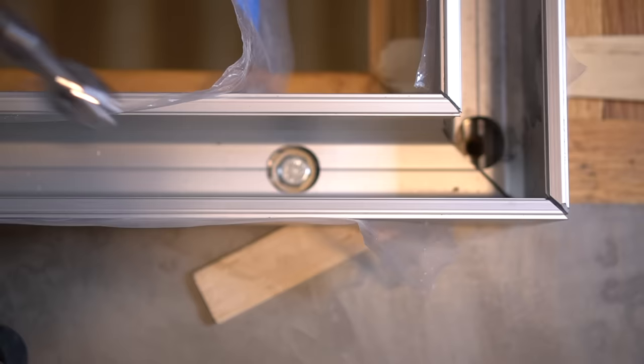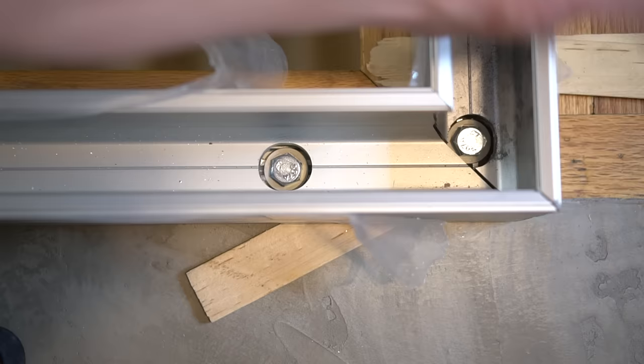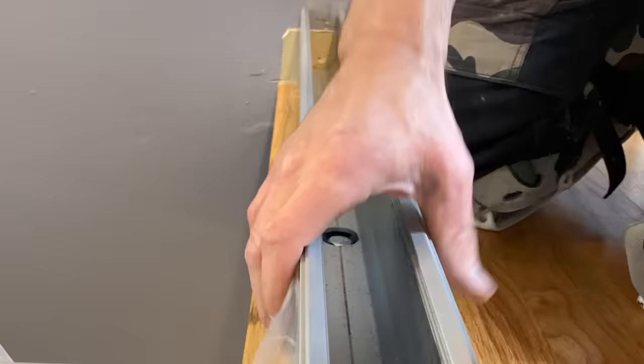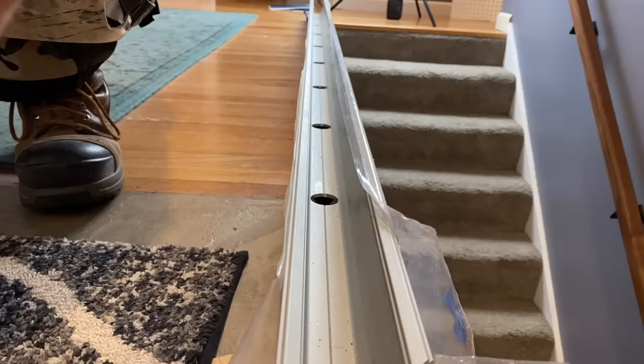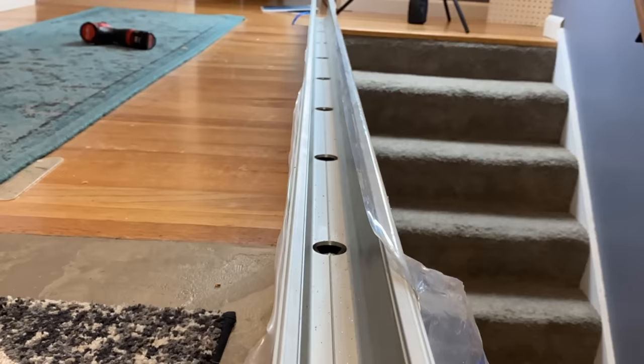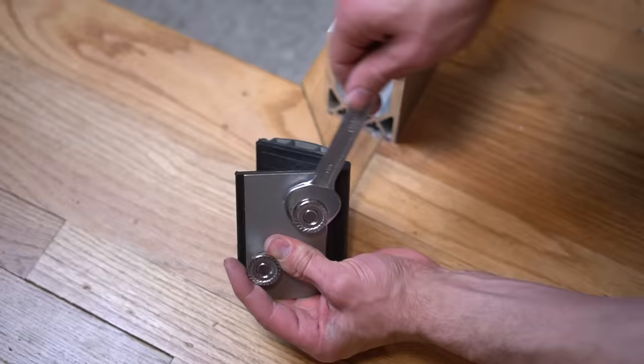I use my impact driver to drive in these lag screws as far as possible, and once my impact driver stops, I proceed to grabbing my drive wrench to ensure as tight a fit as possible. It's actually quite satisfying to fully secure this base rail in place, because the moment you do, you realize there is extreme strength with this entire system — even if there's a large glass panel sticking straight up, it's not going anywhere. At this point, we are now getting close to installing our glass, using these glass grips which are specifically the items that are going to be holding the glass in place.